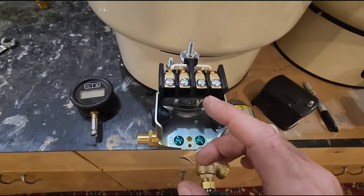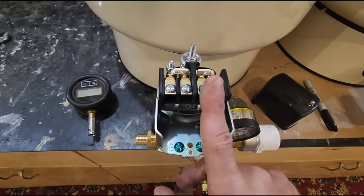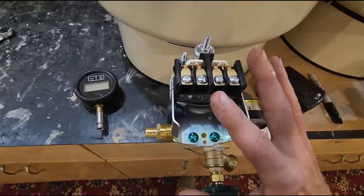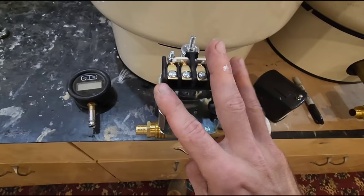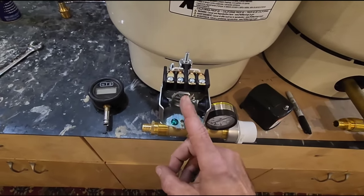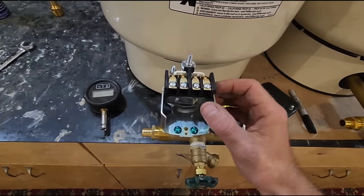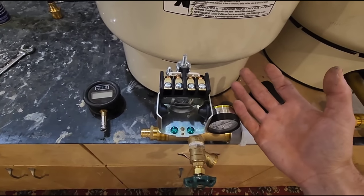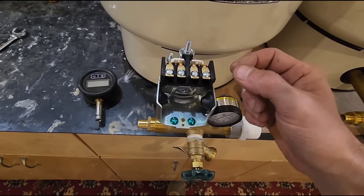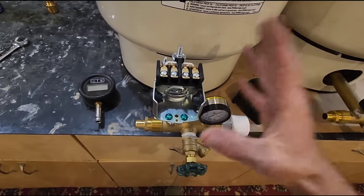These are very simple devices. If you need guidance on how to wire it, a simple way is to put your whites on one side and your blacks on the other — as long as you keep colors side by side you can't get it wrong. You can wire it three different ways correctly and only one way wrong, and if you wire it wrong the only thing that'll happen is you'll pop the breaker, so don't worry about it. If you are replacing your switch, just take a picture of it, mark the wires one, two, three, four and put them back in the order they came off. Don't overthink it.